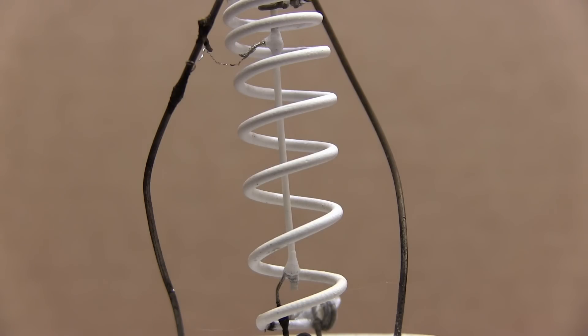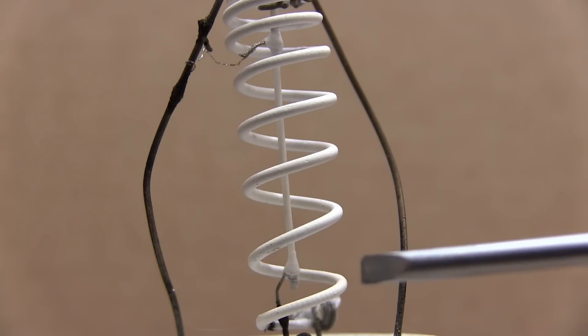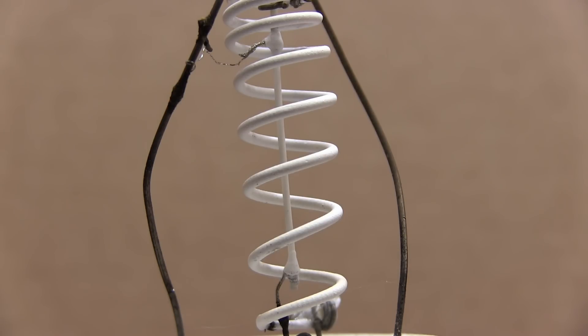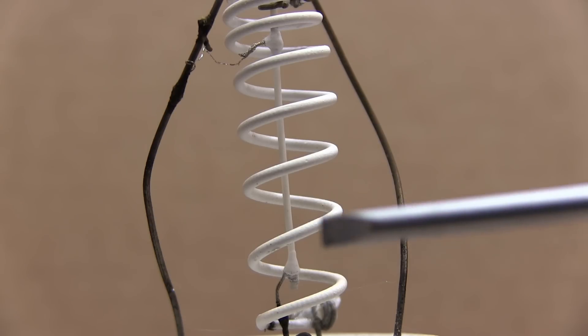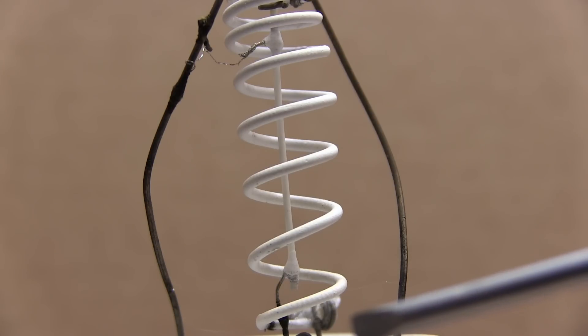Here's a nice close-up of the heater and the actual glower, which is the emitter. The spiral bit is the heater, and inside there we've got platinum wire coiled around some asbestos rope or cotton, dipped in oxide so it can't vaporise or oxidise further — because it's already an oxide. The actual emitter, or glower, in the middle is made of zirconium oxide. There's no wire in it, and it doesn't conduct under normal circumstances until it's heated. Once heated, electricity passes through it, it glows red hot, and that tiny straight bar in the middle is the actual light output. The coils just heat it temporarily and then switch off.